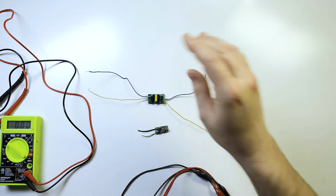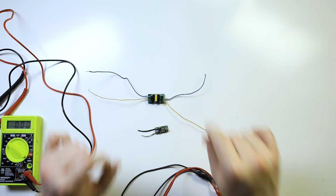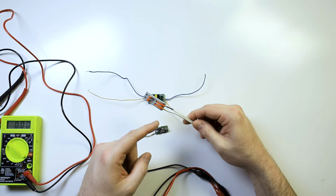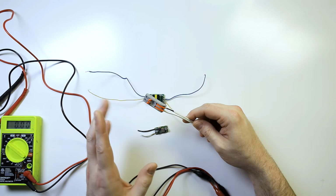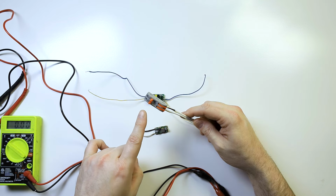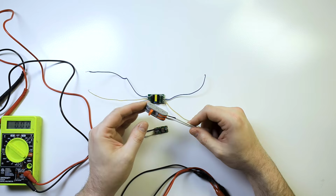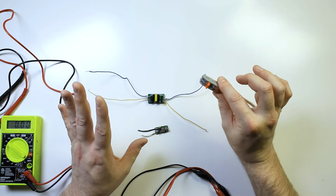And so what I'm going to do is plug a cable into an extension cord over here, which will be putting out 110 voltage. And I'll show you how to do that safely. Hold on a second. So this is now running 110 out of it right here. And I have marked on the cable what the black is. It's the negative, so I know. I'm trying to be very safe here. And I don't leave the wires bare so they can't touch and short circuit anything. I've got them on this lever nut thing here, so I am a little more safe here.